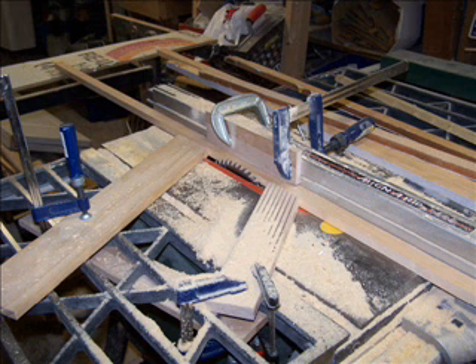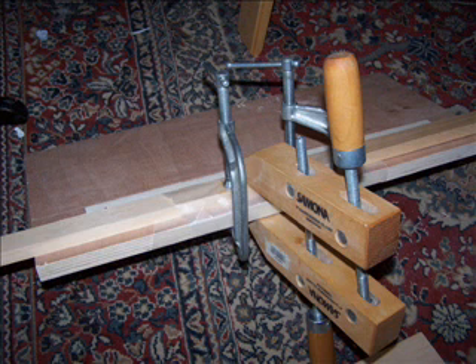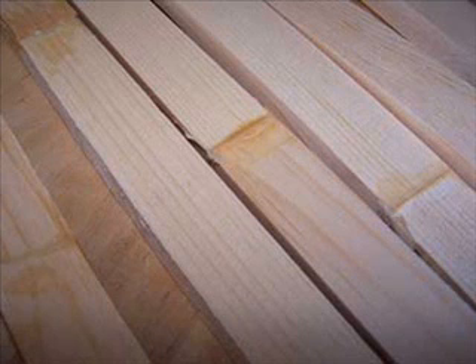The thickness of the wall should be at least 20% of the finished diameter of the mast. This is a setup I use on the table saw to cut the pieces. With the blade tilted at 45 degrees, I cut the notch using a similar setup. My mast was made from old pine shelves, and I cut out the knots and re-scarfed the boards together.